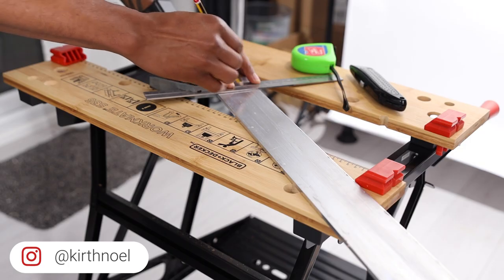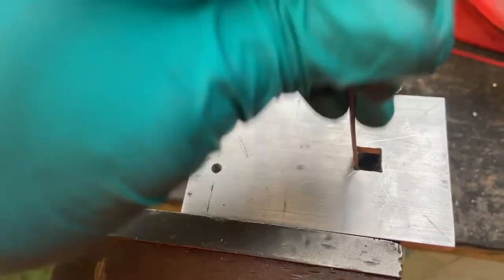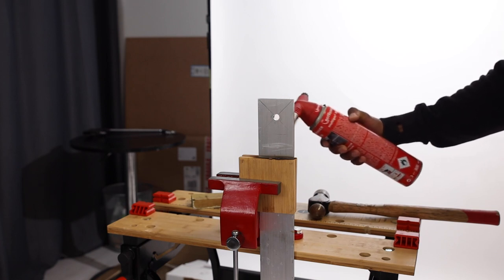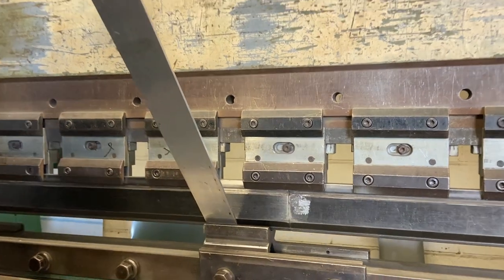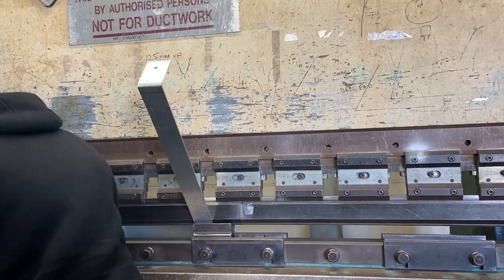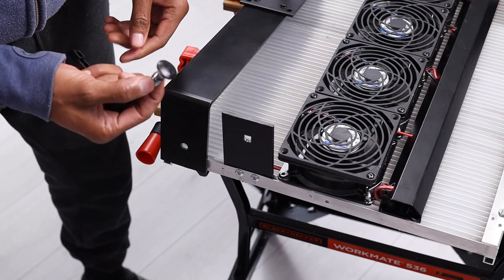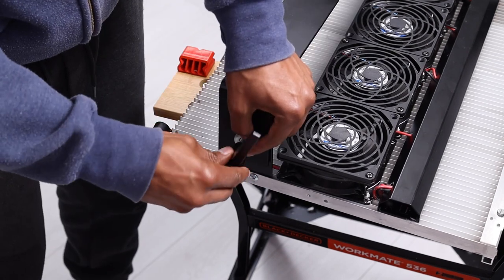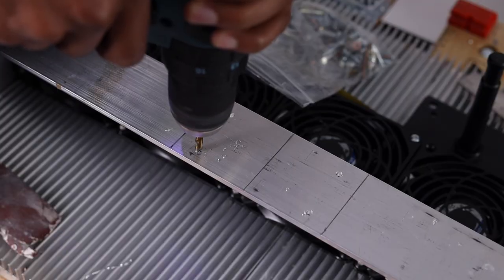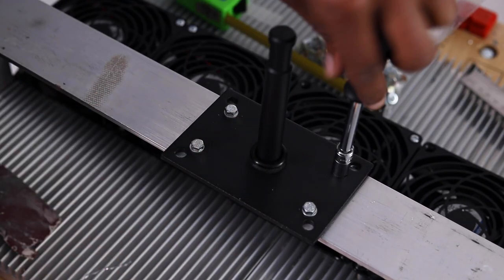For the fancy version, get an aluminium bar, cut bits off at the ends, and carve square holes into the short pieces. Don't try to bend 5 mm thick aluminium yourself after watching a YouTube video thinking you're a metalsmith — just take it to a metalworking shop and let them fold it. Attach the short pieces to the heat sink using self-tapping screws, then attach the frame using coach bolts with square shanks, secured with locking handles. Attach the baby mount plate to the middle of the bar by tapping holes or using nuts and bolts.